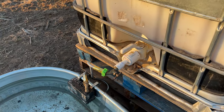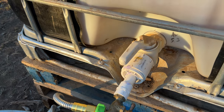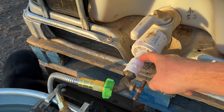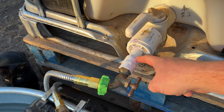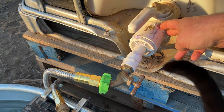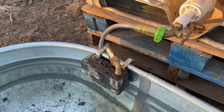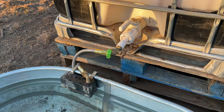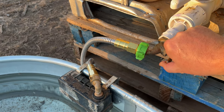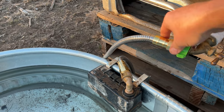Taking a closer look at what I've got here. This is the IBC tote with the valve that's always on there. It's just two inch threaded pipe and then I just have a reducer down to three quarters of an inch, and then regular PVC slip fit to a threaded where I put in a hose bib. That's how I got from the IBC tote down to a hose bib. Then I just have this short little hose right here that goes right down to the float, which goes into the tank.